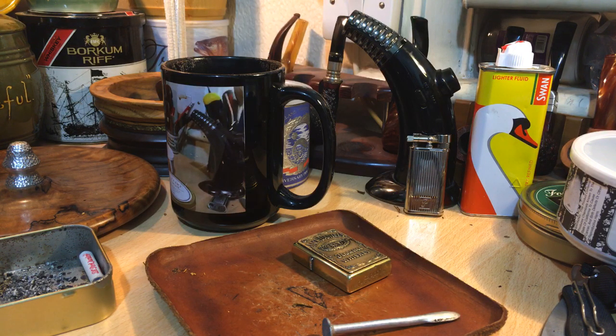Daniel, yeah, that's a good observation. And I think most of the high graders, the artisan pipers, will first shape the pipe so that they can get the best out of the grain, and follow the grain as best as possible to get exactly as much out of the grain as they can before they actually drill it. Once they've done that, then they'll drill the bowl and the draft hole. But for amateurs and for people starting up, I think that would be quite hard to start off that way. And there are still plenty of artisan pipe makers who don't start off by sanding and shaping, and they do the drilling first.